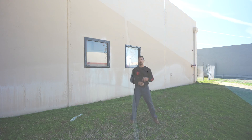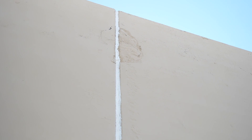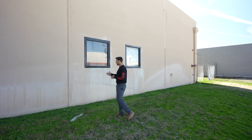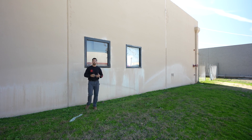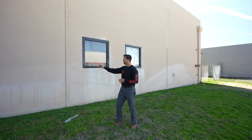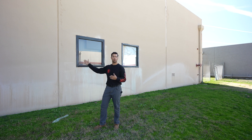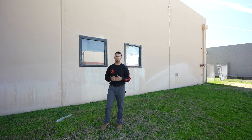Behind me there's an even larger repair where it looks like a whole panel may have settled or moved slightly — which can happen. When performing this inspection I would want to get up to these panels and look up and down them for trueness and plumbness. I'm finding small hairline shrinkage cracks, which you can notate, but this is not a defect of the system — it's a common finding that can be maintained.